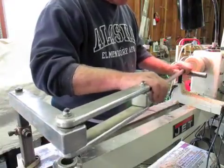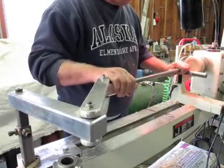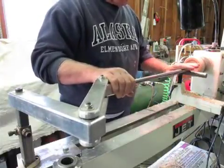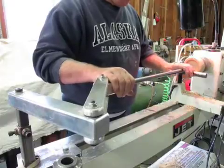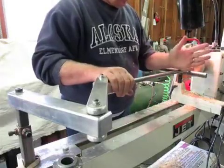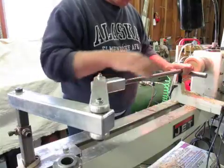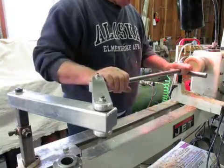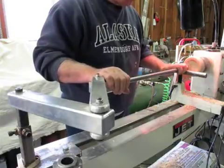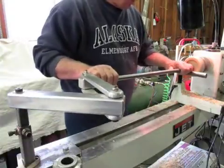I can pull it this way as well. When you're making little cuts like this, usually you do them in increments — you put the heel of your hand against the tool rest and you grip it, and to move the cutting bar you tend to close your fist and then walk your hand out. Let's see if I can make a fairly aggressive cut.